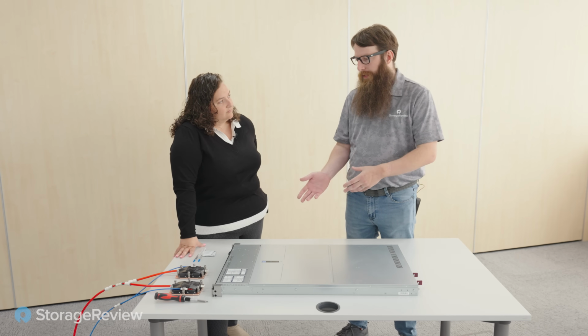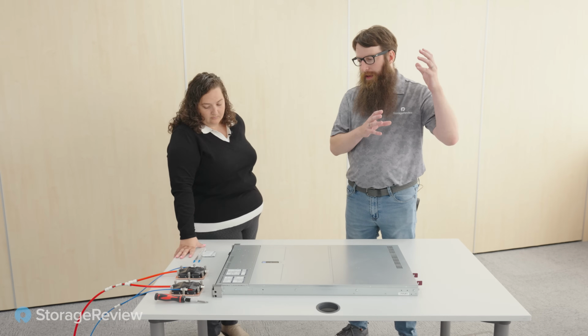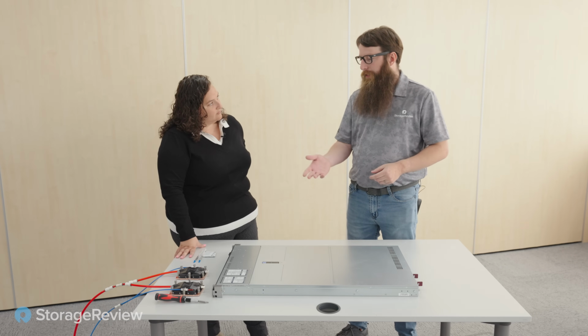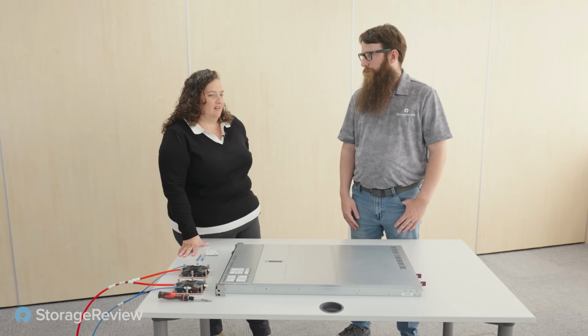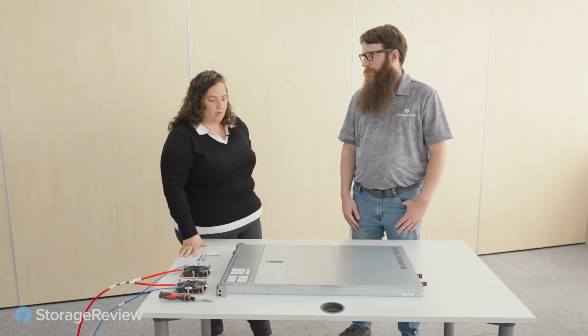Okay. And then what advantages does that bring as far as the total system? Like when we start thinking about the CDU, or in your case, the heat rejection unit, the HRU, and the manifolds that come in, what advantages does this type of system have? So first of all, servers are not people. They don't need to remain at 25 or 30 degrees centigrade in the room. They can work at higher temperatures, and this is what we do. We're allowing them to work at higher temperatures.